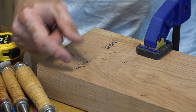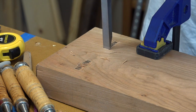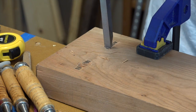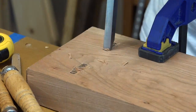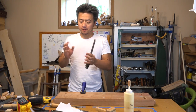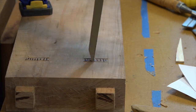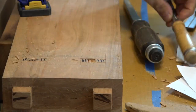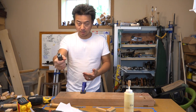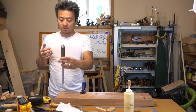So the Japanese and Chinese tend to start from the middle and work their way out, whereas the English — or the European probably as well — tend to start from one end, about a sixteenth from that end, and then chop their way across. I use a combination of both. When I start off chopping a mortise hole, I like to use the Chinese, Japanese, and probably Korean method, where I start from the middle and rotate the bevel back and forth until I get it down to probably an eighth of an inch. Then I like to switch over to the Western, European method, where I start close to one end and move my way across, because I find it's easier to get a rhythm going, whereas the Asian method is really easy to get it started.